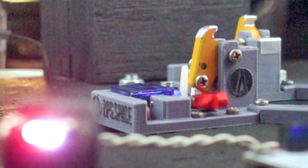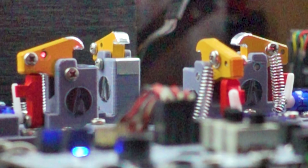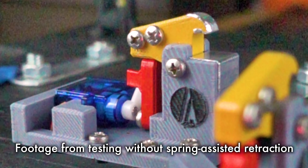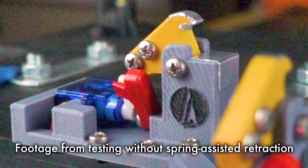Let's talk about the pros and cons for these clamps. Pro: it's crazy simple — love how easy it is to just knock that pin out of the way. Pro: no static friction. The clamps just open up, and even if they don't open up, as long as that pin is out of the way, the rocket will push them open, or the spring will retract them open — they want to be open. Pro: low actuation force. Especially because the servos get moving a little bit, they have a tiny bit of momentum in the gearbox, and they can just knock that pin out of the way with almost no force, even when the rocket is thrusting really hard against them.